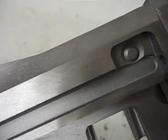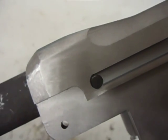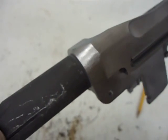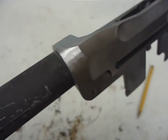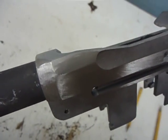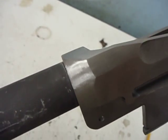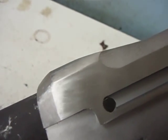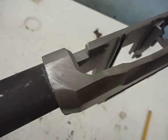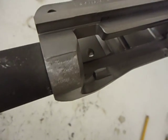We're coming down to the home stretch now. I just wanted to go over this real quick — we only got really one area left to work on. I just wanted to show you what we've gotten done so far. I got that area around the barrel ring all done. Any little discrepancies in the file work there, I can see a couple little minor spots where the light's hitting it, but I'll go over that with a block and some emery cloth. You'll notice that all those lines are nice and sharp now — none of those lines have been knocked off. That whole side is looking good, all around the front's looking good, that top is good. I saved that line right there. All around the barrel ring is good. I got all that pitting out of there.